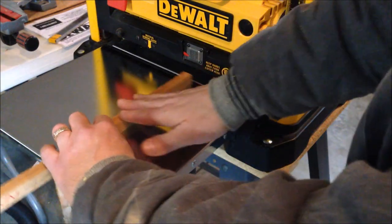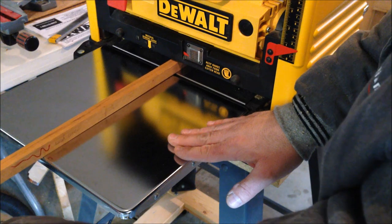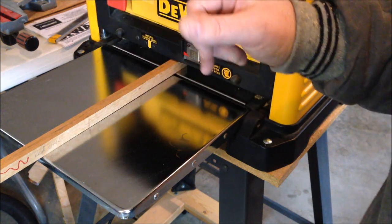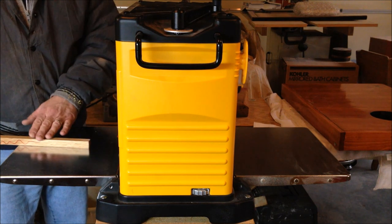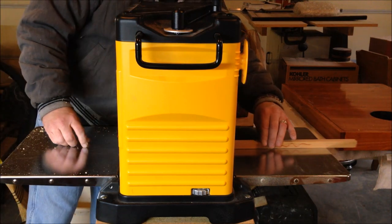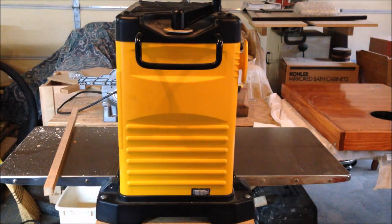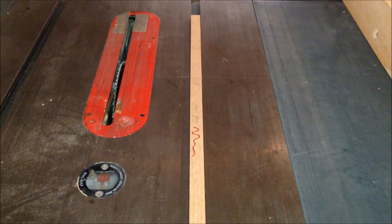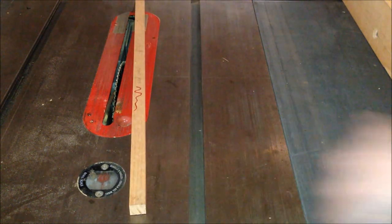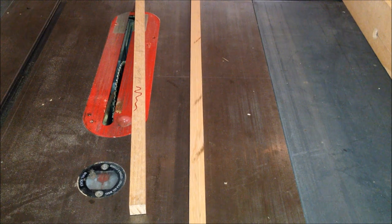At the planer, I adjusted to where I felt just the slightest bit of resistance when I inserted the wood manually. I want to take the least amount off as possible because I really want to sneak up on the width for my slots on my table saw. On this piece of oak I actually planed a little too far and you can hear there's a little bit of play. So I grabbed another piece of oak, planed it down, and got a nice tight fit with no play — luckily I had a spare piece around.